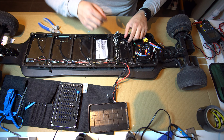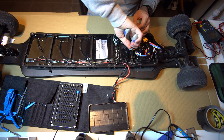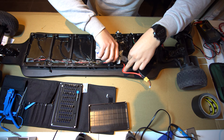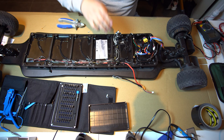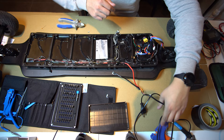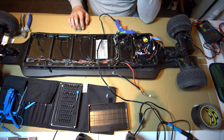Now the last step is to disconnect this one — let's cut it as far away as possible. And let's tape this one as well. Last step is to snip off this one. Now the BMS is fully removed electrically. For this purpose I'm not gonna get the BMS out physically — it's too stuck in here. I have a heat gun, I tried it, it's really stuck, it's not worth it. What we're gonna do is glue the contacts together using a hot glue gun.